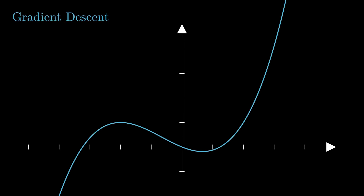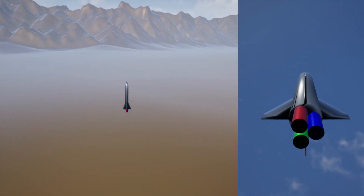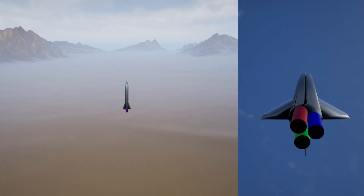To minimize this distance function, my first idea was gradient descent — an algorithm where you calculate the slope or derivative of a function with respect to a parameter to figure out where it is descending, and then take a step toward that descent. Although this method technically works, in simulation the gradient descent iteration tended to follow behind the true minimum solution that is moving around, leading to a delayed response and eventually an oscillation disaster.